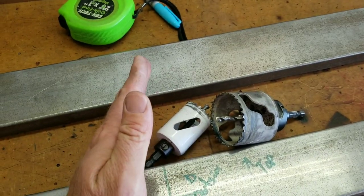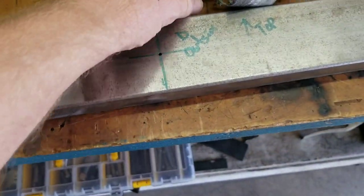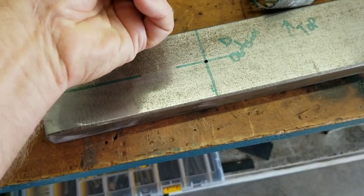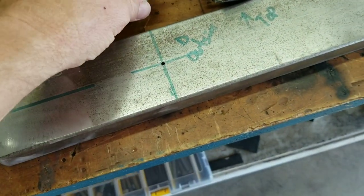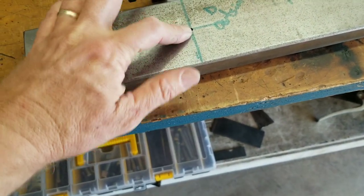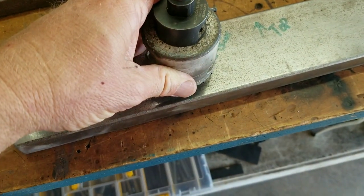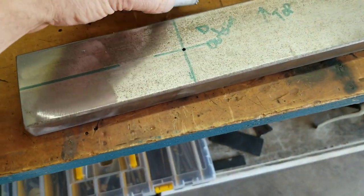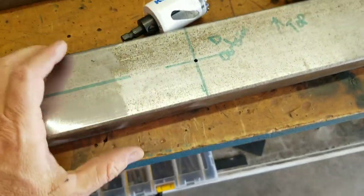Inch and a half gives you a little clearance around the axle in case things are slightly misaligned — and usually they are, because the angle of the frame splays out a little bit and the axle goes straight across, so it'll be a little closer on one side. All of mine are done with the inch and a half size and it works just fine, so that's what I recommend. I've got a pilot hole drilled. I'll do the big hole first and it should plunge all the way through and center the other side.